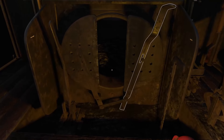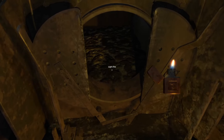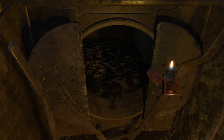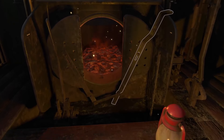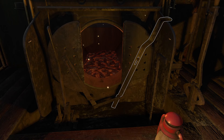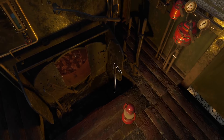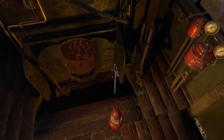Usually with the regular shovel, it takes about three shovels to fill the box. Once you have it full, you can take your lighter, open it up, and light the fire. As you can see, it's going down pretty fast right now because we have our damper completely open — which is this right here. This controls your fire temperature, largely when stationary.